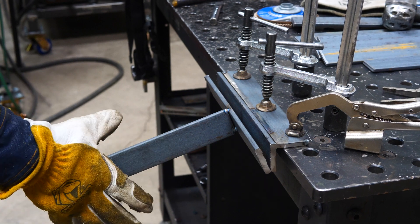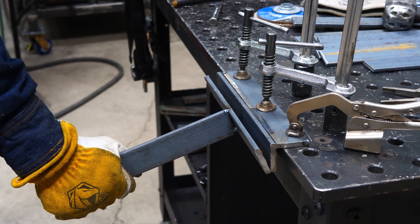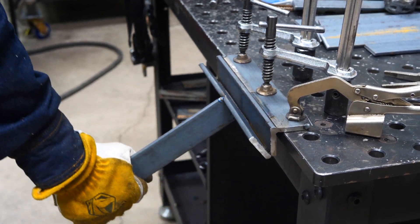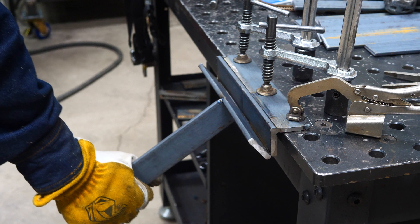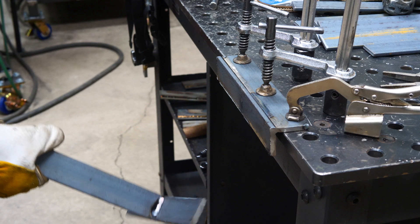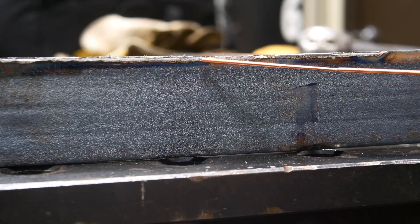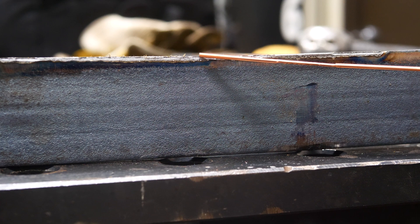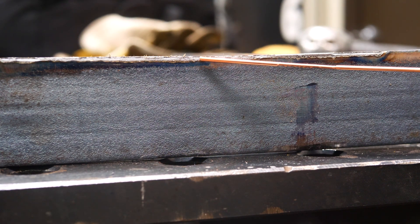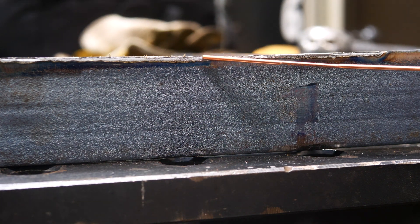With the extension welded on, just leaning on it — there we go, it came right off. Let's look at the cross section of that outside corner joint. You can see that little part there was the weld. I've got a 1/16 inch rod here, and you can see the depth of penetration was about a 16th of an inch — and that's just not enough. That weld broke really easily, as you saw.